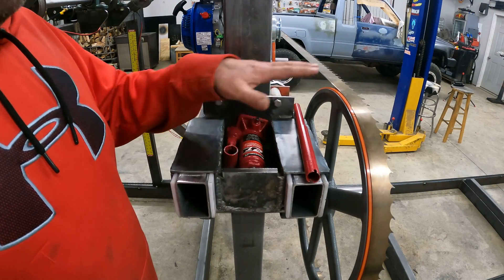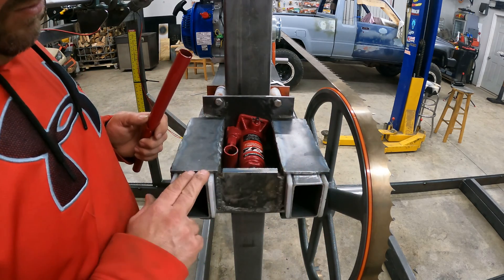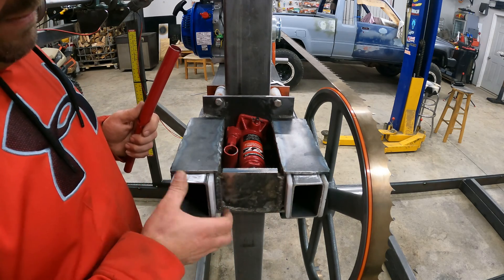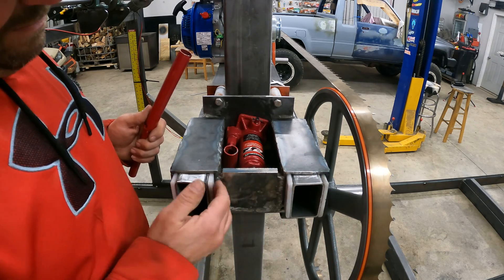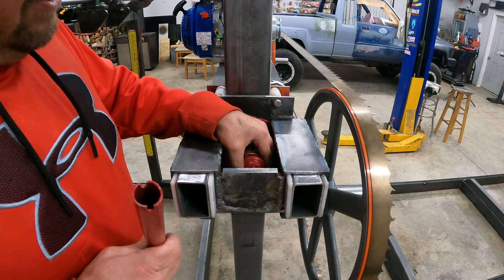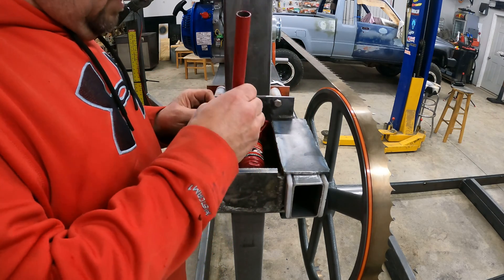I've got my tensioner side pulley all mocked up and everything welded and in place. What I've done here — I've basically created a box around the two-by-threes across the carriage frame and boxed all that in, tacked it in. Then I took some UHMW quarter-inch plate and bolted it to either side of the two-by-three to give it something to ride on. I tacked everything in, this 3/16" plate, boxed it all in, then pulled it off and welded it all together. Down in here I put this half-inch plate to get my tension, and I'm going to use this bottle jack — it's a two-ton — to apply pressure to the blade and put the proper tension on it.